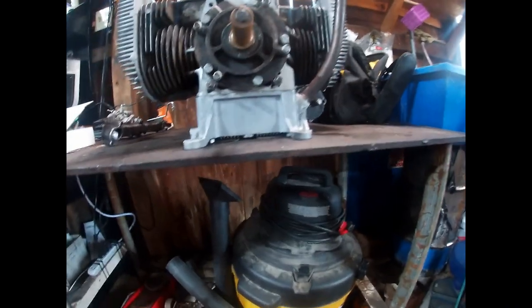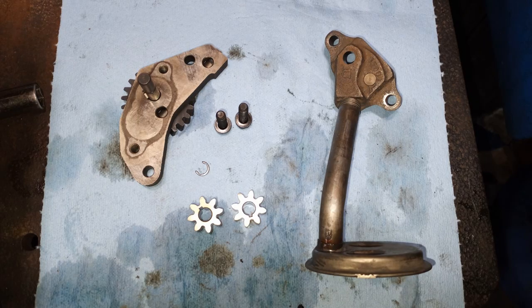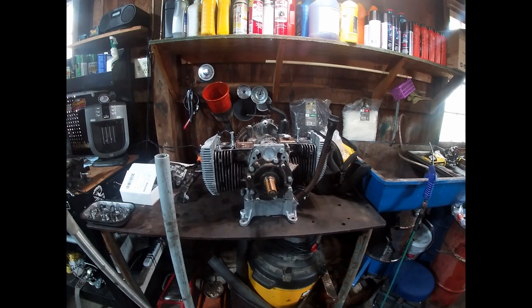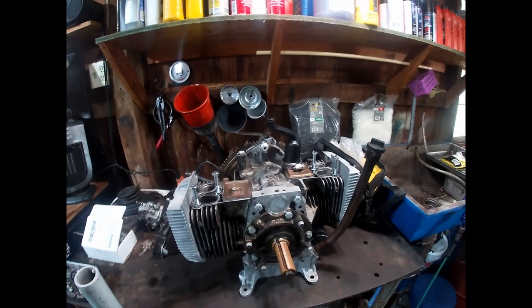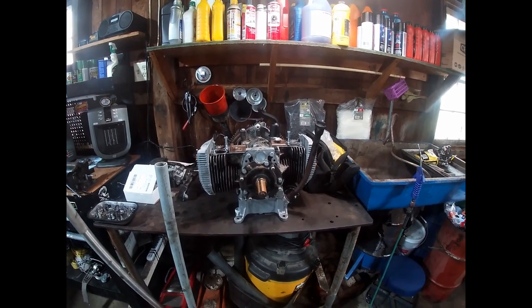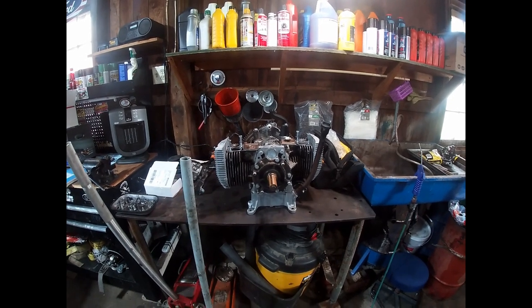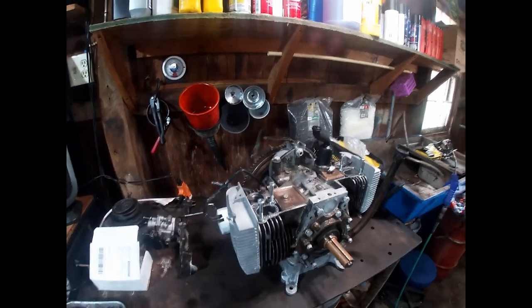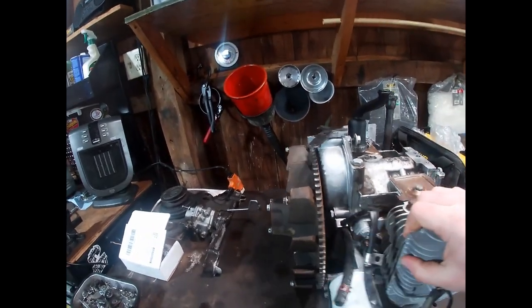Also, per the advice of Boomer — my parts guy — I rebuilt the oil pump. That's very simple to do when you take the oil pan off; the pump is very easy to remove. It's just a simple gear pump — one gasket basically — and the thickness of that gasket sets the backlash on the two gears. The oil pump rebuild kit from Boomer's Onan Parts provides three new gaskets of different thicknesses depending on what your original gasket was, as well as a new key. So that was simple and easy to do, and the oil pump should be good for many more hours of service.